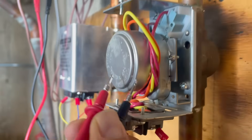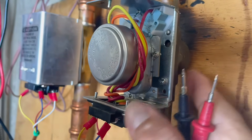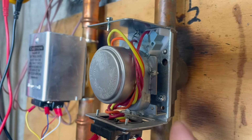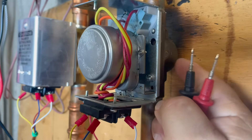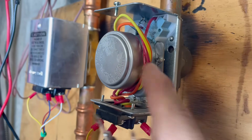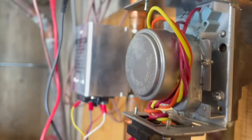So the motor is faulty and it needs to be replaced. Even though when we replace the motor, it could be the insides — the guts — that are broken inside. So you might change the motor, you might change the whole zone valve, but it's the guts inside that need to be replaced. We don't know yet, so we're going to replace the motor for now and watch that switch travel — the golden pallet — and it should activate that switch.